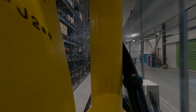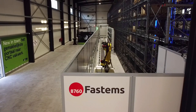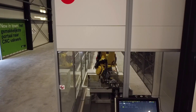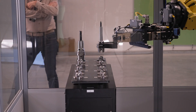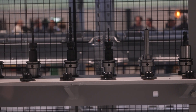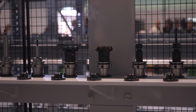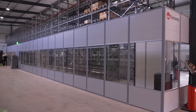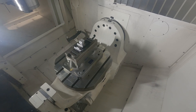This section is unloading worn-out tools. You can see the white racking just to the right-hand side of the robot — that is full of tools. Tools don't last forever, so when a tool has worn, this robot will take it and place it in that block so that it can be changed, or tips on a face mill or high-feed can be swapped. Once that's done, new tools are loaded back into the block, the system comes and picks up that new tool and puts it where it needs to be. They also had sister tools for each tool so that the machine never ever stops.